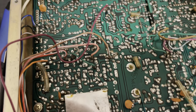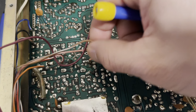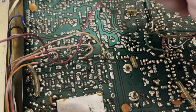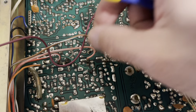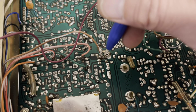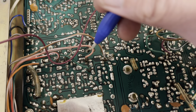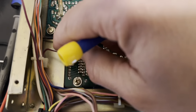This is a little different than a TRC-449 or Cobra 138 in that they have these wires here — our clarifier wires — terminated to the solder side of the PCB, as opposed to the component side on a 138XLR, 139XLR, or TRC-449. This right here is our 8 volts for the clarifier in receive on a stock clarifier. And this is our center leg of the clarifier potentiometer terminated here. The other leg of the clarifier goes right to here.